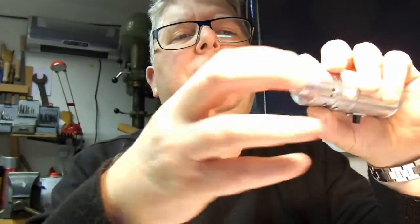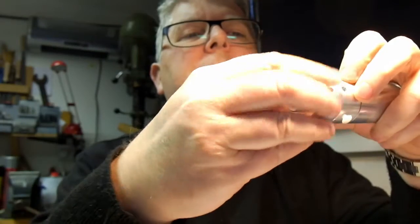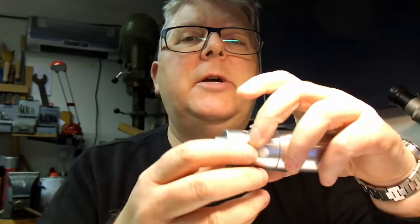But for aligning things like Adam's rear steady, which is at the back of the headstock of the lathe and out on a long bar, this would be really good. You could just chuck this into a three jaw chuck, or stick it in a four jaw chuck and true it up, and it would shoot up the spindle, and you would cast concentric circles onto the rest, and you could then get the arms absolutely perfect.